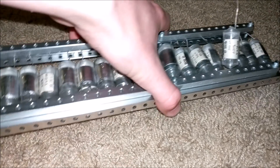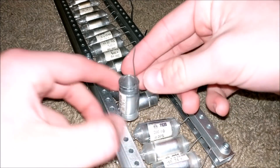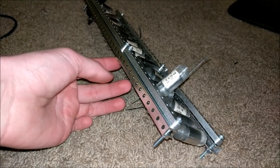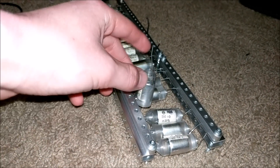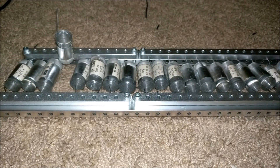So this is my finished capacitor bank right here. I've already tested this out on the tesla coil circuit and I've already had one capacitor go bad - that's not good. This capacitor is shorted to 59 ohms. But all in all, this whole capacitor bank is about 7 nanofarads, which is pretty cool. It's a little bit below my estimate, but it's about twice as much as my previous Leyden jar model capacitors.